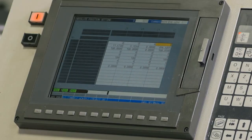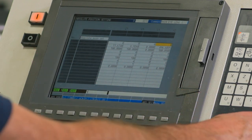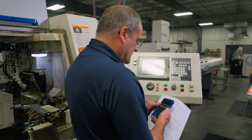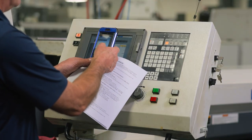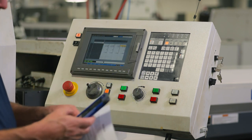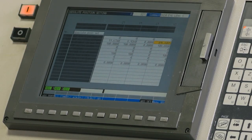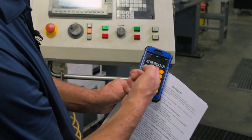The adjustment is 0.08763mm. Press ABS Set, enter 1 — that allows you to change the value; without that step it won't let you modify it. It's always a 50/50 shot which direction to go. Take a picture first, then I'm going to add the value: the new grid shift will be 496.6085 plus the adjustment. Enter the new number.